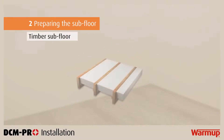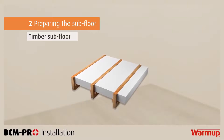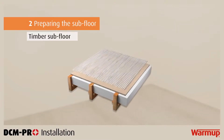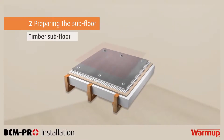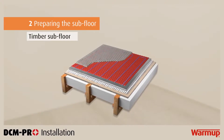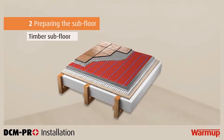For a timber subfloor, the process is slightly different. You should see the following structure in your flooring: insulation between a series of joists, a floor deck, flexible tile adhesive, warm-up insulation boards screwed down, the DCM Pro mat, your DCM Pro heating cable, tile adhesive or self-levelling compound, followed by your chosen floor finish. For further information on preparation of timber subfloors for tiling, refer to local tiling standards.